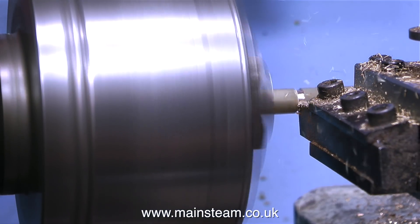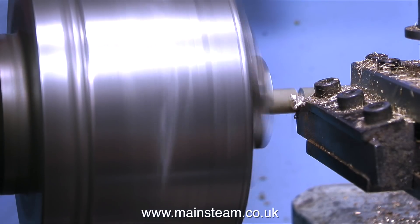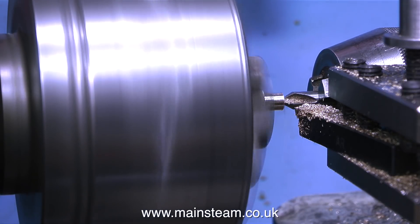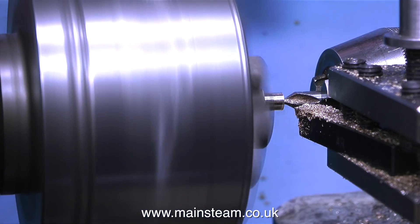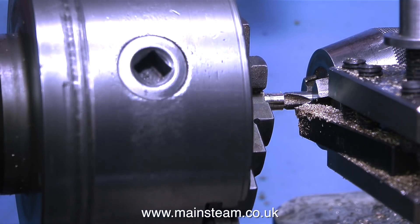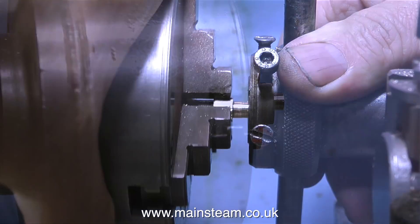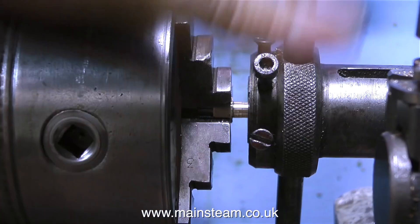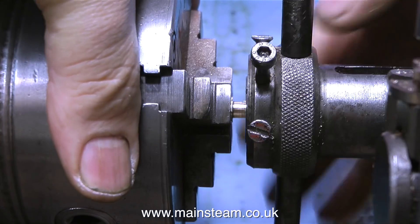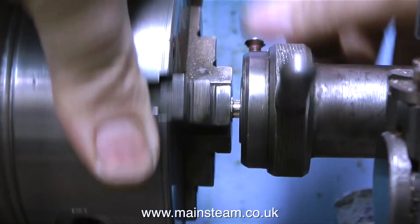Then it's back into the lathe to part off the piece of brass hexagon I need for the next part of the job. I'm doing all this work in the small Boxford, and even the parting tool works well in this lathe — it's very good. I didn't drill the other end of this piece of brass deep enough with the twist drill, but it was so very close that as soon as I used the center drill it broke through into the hole already there, so I don't need to use a twist drill on this. The next job is to thread this end quarter-by-32 threads per inch. I have about four tailstock die holders of different ages, so I try to put the most popular dies permanently in these and just reach for the correct one — it saves quite a lot of time changing dies and setting them to cut correctly.